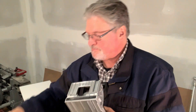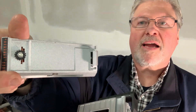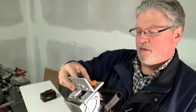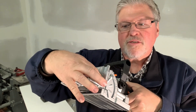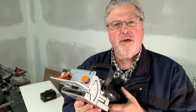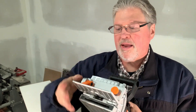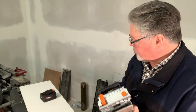You can see there is a rack — a straight gear — and on the back of the fence there's a pinion, and those parts slide together. You can then use the knob to raise and lower that fence. One concern people noted with the corded version was that it was possible to lock the fence out of parallel with the blade. Playing around with this, I can see how you could do that. So before you lock it down, I'd suggest applying some pressure against the side where the fence locks. At that point it looks parallel to me, but we'll check that with some plywood to see if we're getting slots that are parallel with the face.